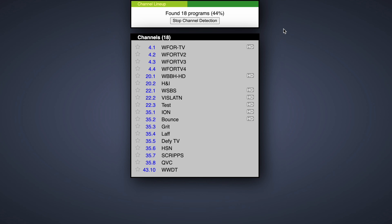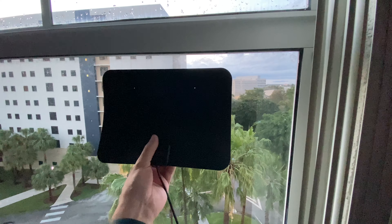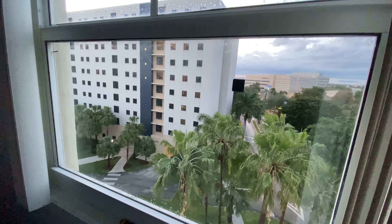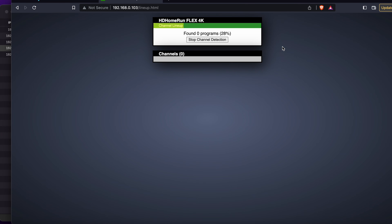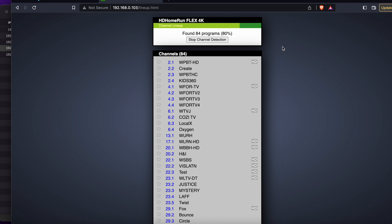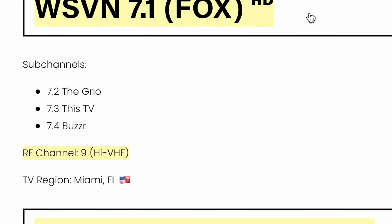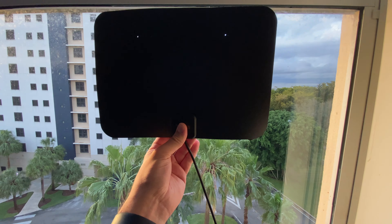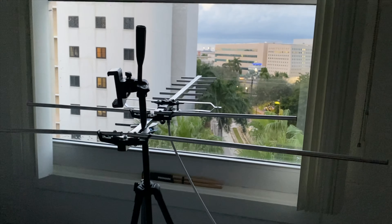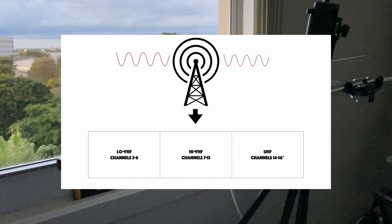In my scan, I got 116 channels. My signals are very strong here in Miami, so I'm able to get a lot with this small antenna. Personally, I've been using a much bigger antenna in my room. Reception is decent with a small antenna, but it can be even better with a larger one. I did a fresh channel scan with the larger antenna and got 126 channels compared to the 116 channels with the smaller one, and the signals were coming in at much higher signal quality levels. This was especially noticeable with the lower frequency TV channels called VHF channels. The small mudflap antenna wasn't made to receive these lower frequency TV signals, and this larger one was. If you're curious to learn more about how antenna TV works, watch the video recommended in the card above or in the pinned comment below.